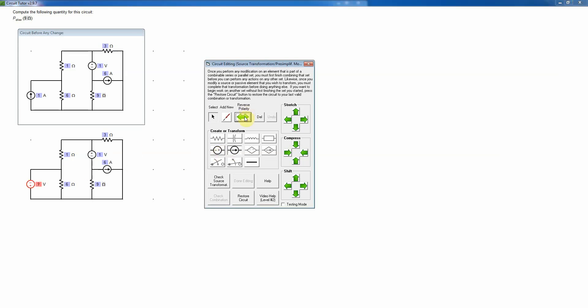I'm going to click on that and change it into a voltage source by clicking here. I need to correct the polarity because it should be pointing in the direction to give the same current direction we had initially. Then I'll put in the new voltage value — using Voc = Isc × R, that would be 1 amp times 6 ohms, so this should be 6 volts. Now I'm going to delete that wire by clicking on it and pressing the delete key on my keyboard.